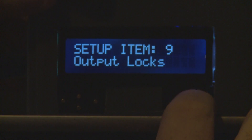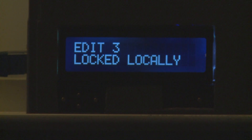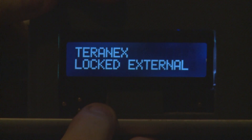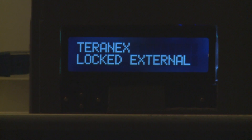For output locks, enter shows the destination on the top row and its lock status below. The first destination is unlocked and you can cycle through each of the 24 destinations. One destination is locked locally, meaning this box locked it and only this box or the controlling server can unlock it. You can toggle between lock and unlock using the arrow keys. When locked, nothing can change the destination of that cross point. Another locked destination locked by a different unit shows as protected — nothing can be done to change it from here; you'd need to go to the controller that locked it or to the server.